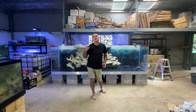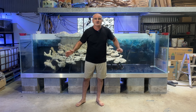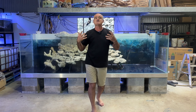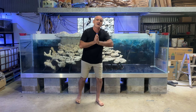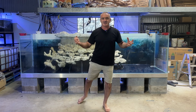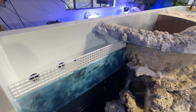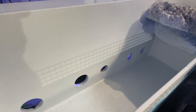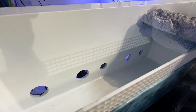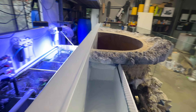The other big thing about tempered glass is that you cannot cut it — you cannot trim it to size. Once you've got your tempered glass balustrading, that is the size you're working with. And because you can't cut it, you also can't drill it, which is going to be a big problem if you've got an all-glass aquarium. I went and pre-drilled the holes for my bulkheads in the overflow in the rear plywood wall of this aquarium instead.